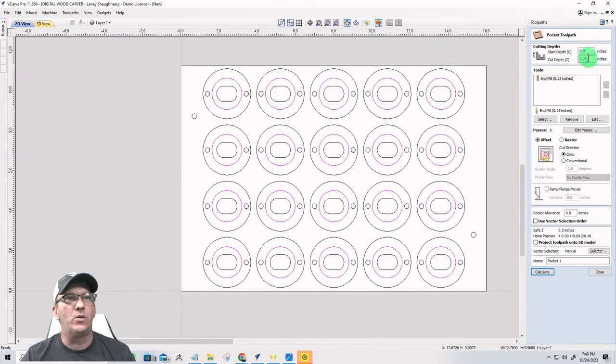All right, so our first pocket is going to be the main insert pocket here. And this is going to be going 0.1 inches deep. Now, that's how thick our part is. Our bottle opener insert is 0.1 inches thick. Now, just in case there's some deviance for whatever reason in their batch that they run, or what have you, there shouldn't be, but if there was, we might want to recess just a little bit.